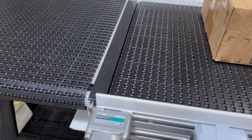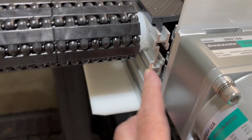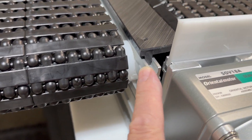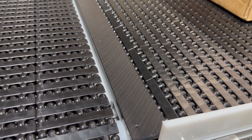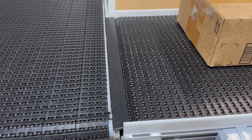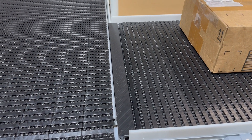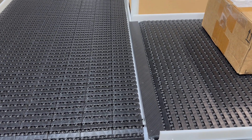The first requirement is that the frame of the conveyor has to be lower than the height of the belt. Otherwise you're not going to be able to go across. Regardless of whether you use our conveyor or someone else's, that's going to be the first requirement — otherwise you'll really be waterfalling from one conveyor to the other.